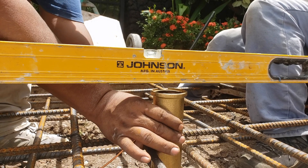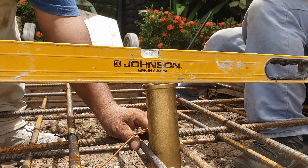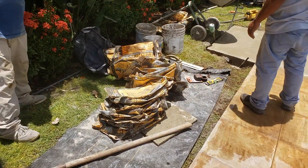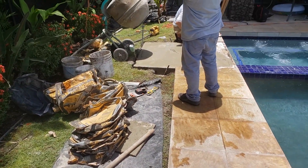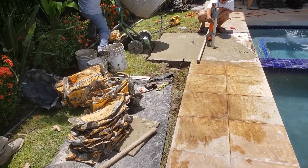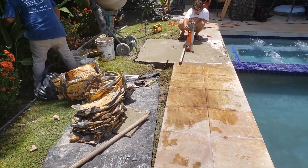Keep it perfectly level — if it is not perfectly level, you're going to have a major problem when that concrete hardens. Make sure you've got two levels and pay good attention to that detail as the concrete is going off. Regarding the concrete bags, we picked up 38, and for this four-by-four-by-ten-inch pad we used exactly 34 bags. So minimally you'll want to have 36 bags with you — make sure you always have 36 bags otherwise you may come up short. 34 worked great for us.